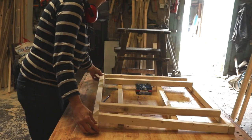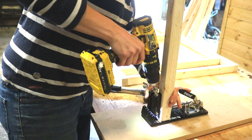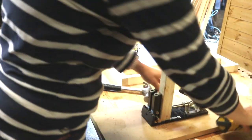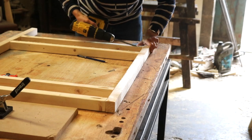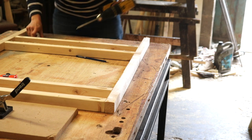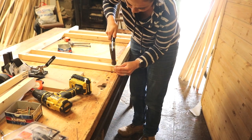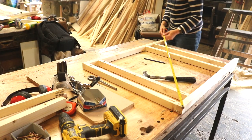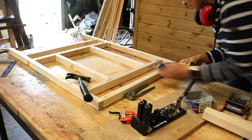Once those were in place, I knew where I needed to cut the door opening pieces. When it came to screwing the frame together, this was actually the first time I showed my dad a pocket hole jig. He's been toenailing nails and screws for years, but being a traditional carpenter, he thought the joins looked far too weak and took longer than pre-drilling and screwing. So that's what I did for the rest of the build — you know what dads are like. Then I nailed part of it to the workbench, checked for square with a tape measure from each diagonal point, tapped it to be square, then nailed the rest down and pre-drilled and screwed the openings frame together.